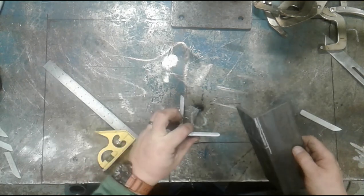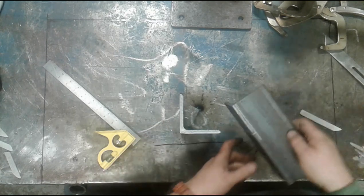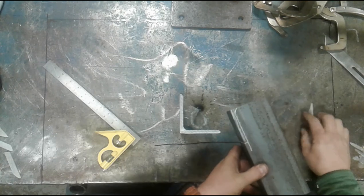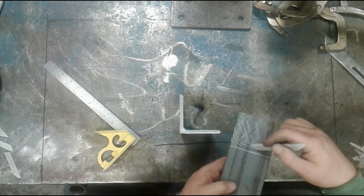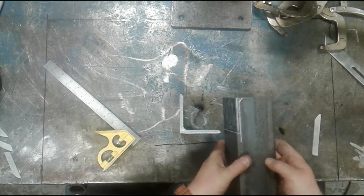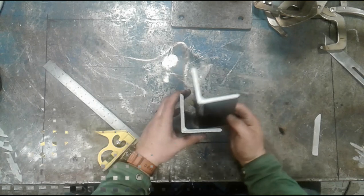There is a radius inside all angles, so that sharp corner that's remaining will bump into it. So the last step is to remove it. And again, I'm just gonna make a slight mark. So everything that's scribbled in white on this is gonna be removed. And I'll go ahead and cut these in the cut portion, and then we'll come back and we'll weld them.